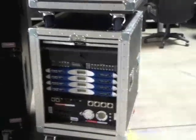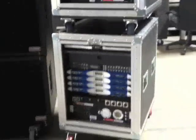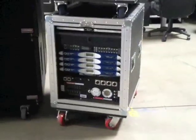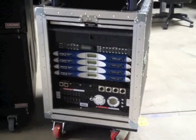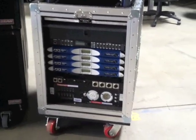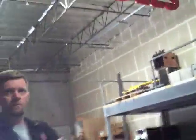Below that we have two PowerSoft K6s running the horns and high mids, and below that are two PowerSoft K10s running all of the 10s and the 740s — there are four 10s in each 740. Below that, from CBI Cables, we have a digital and analog I/O panel, single rack space, set up to use the proprietary UNET from EAW. Our drive snake system has gone from about a thousand pounds down to about fifty pounds all in — everything's Cat5 running UNET.